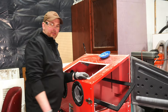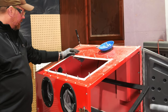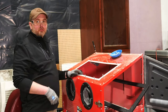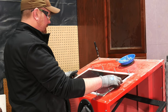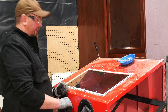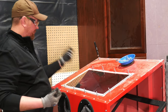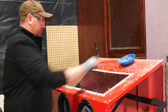Okay, so now I've got these rivet nuts in place — one of them is a little loose because the gun broke on it, but it's in place. I'll have to try to get another rivet gun to finish that one off. Now I'm going to grab the piece of glass, set it right on there and drop it in place. Another benefit is having at least a couple of bolts come up from the bottom to hold the glass in place instead of having it slide off and smash on the floor. The reason I'm not doing it on all of them is I don't have enough long bolts.